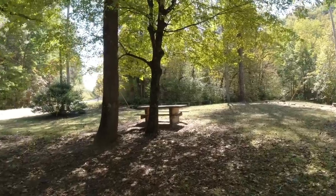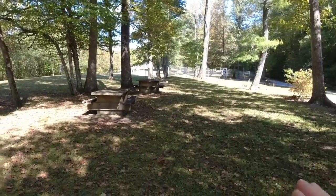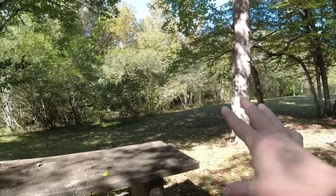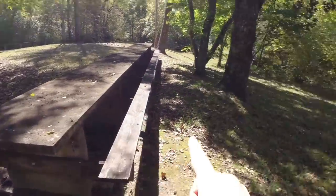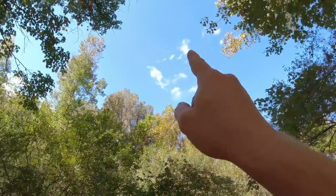Next thing is, if I'm operating a vertical, like I said, I would look for a spot where I could set up the vertical and the counterpoise and my feed line so that it would be within my field of vision while I'm operating. So for example, here, if I were to set up here, I would probably run my vertical here because there's an opening right here.